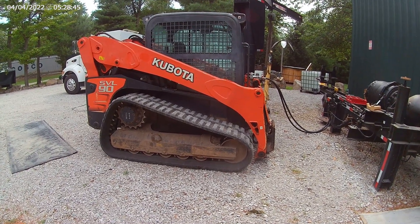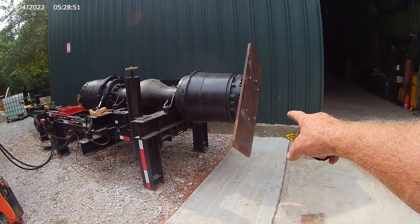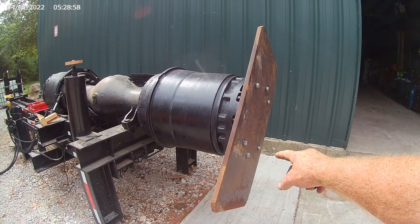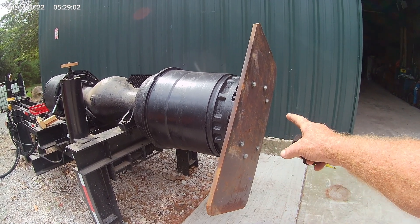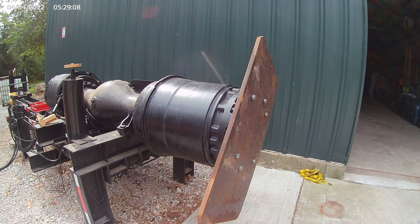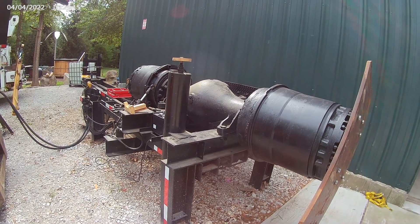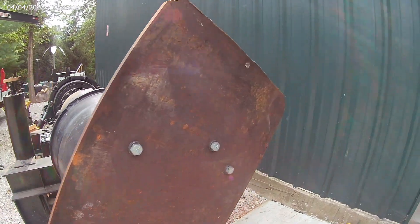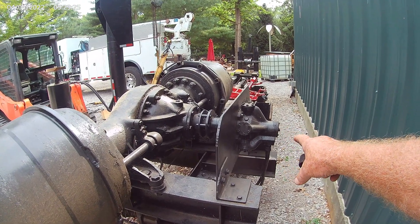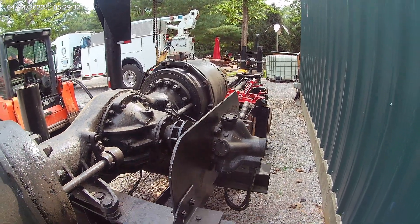So this is what I'm powering my hydraulic machine with. On this end, this plate right here, I want to drill this and make an engine rotator out of it for big engines — you know how you crank a rotator around. I can drill it for all different kinds of engines. I've got a rear end out of an old 22-ton Euclid haul truck, and I used a thousand foot-pound hydraulic motor to drive it with. I made my own little coupling. It's big and heavy and weighs a lot.